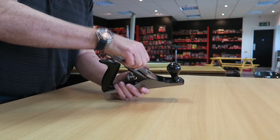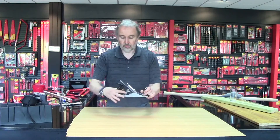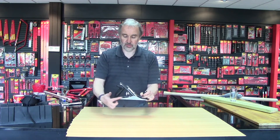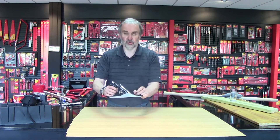Put the cap iron back on and tension it with the lever. You can now adjust for the cut you want — whether it's a very smooth cut or a very coarse cut — by adjusting this lever here. Hopefully that makes your planing a lot smoother.